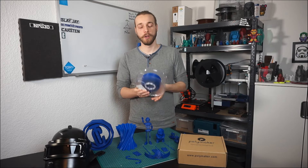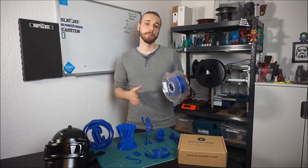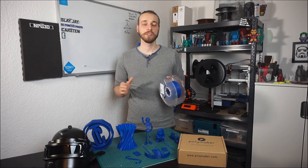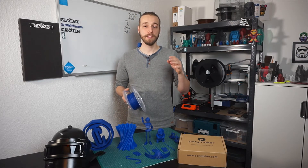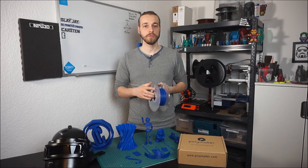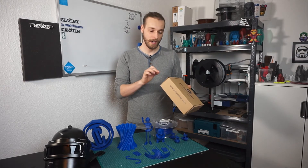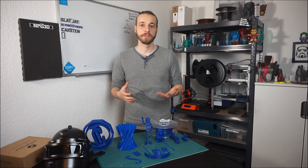As you can see, I've burned through a lot of the spool already to make some prints to see how good this material can actually print. I usually have a standard setting for PLA material and do not change anything besides the printing temperature — only changing other parameters if I really can't get a good print. I tested nozzle temperature from 195 to 215 degrees in three steps. The box says it's printable from 40 to 90 mm/s and from 195 to 230 degrees, but you want to figure it out on your own.